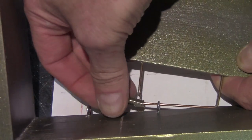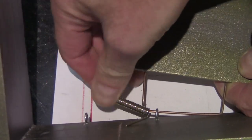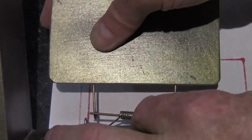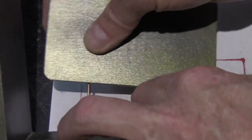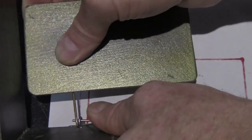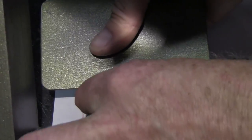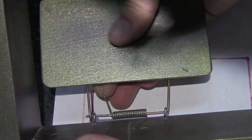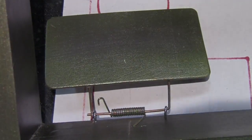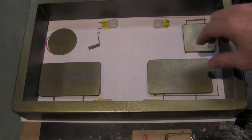They have staples in the actual mousetraps holding them down, but the screw eyes give you a more secure bond. Now the spring fits over the horizontal part of that bar, so that goes through the spring, then through the screw eye. And then the bottom part of the frame hooks over the wire — I just followed the design that was actually on the mousetrap itself. Then this part of the spring that goes up has to hook over the wire so that it can power the flap into position.